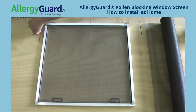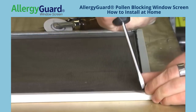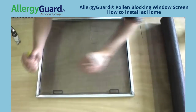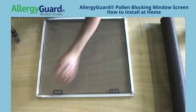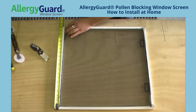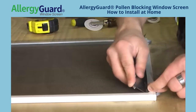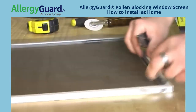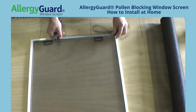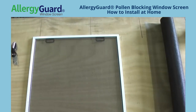After your screen is splined in, trim off the excess spline. Now take a screwdriver and press in the corners of your spline if necessary. Before you move on to trimming your excess screen material, check the bow. Your frame may have a tendency to bow in if it is fabricated too tightly. Make sure it is close to your measurements so you don't have a gap when you install them. Now take your utility knife and begin cutting off the excess screen material on the edge all the way around the screen, right above the spline. Be careful not to cut the spline or the screen material.